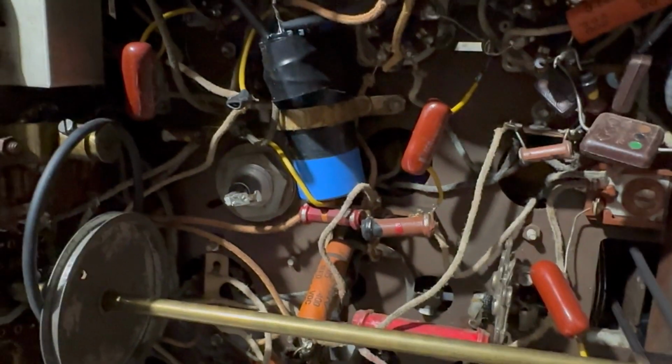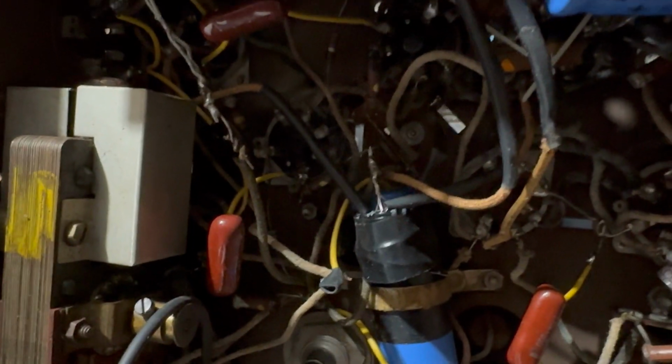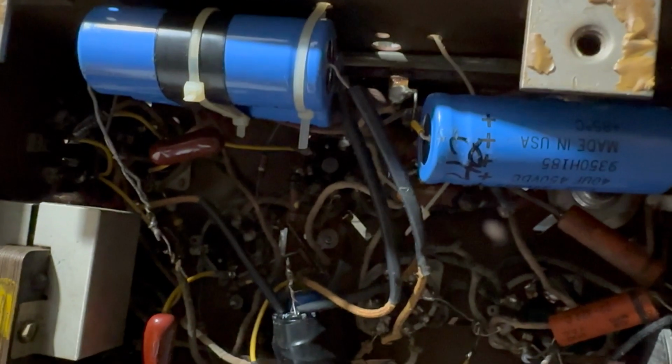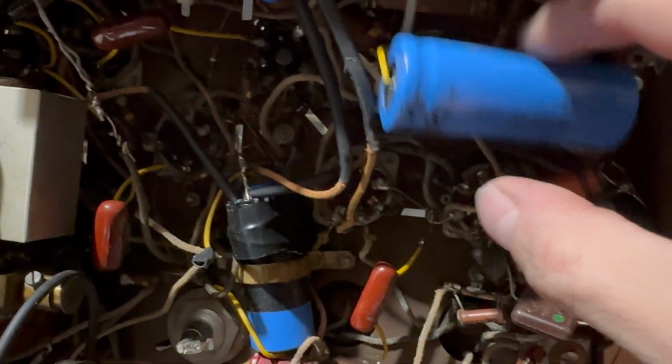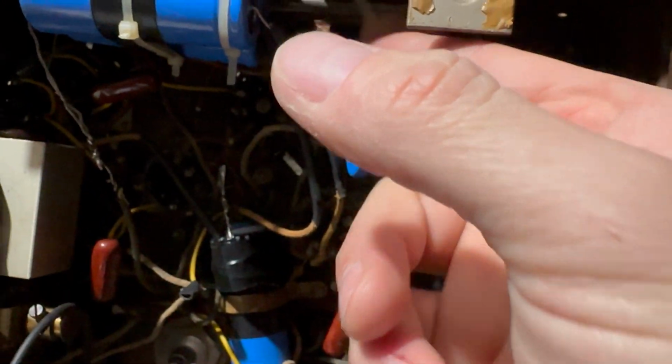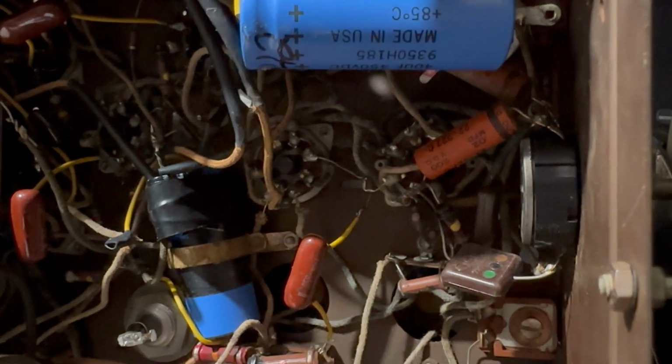I think the way to handle this is to replace the rest of the capacitors. I can leave what they left, I guess, or leave what they changed. Check out this can dome. Make sure it's okay. If it's bad, then we'll change it. I can't really see it from here without these big floppy capacitors. Like, oh my god, what? Zip ties. I love zip ties. They're great.